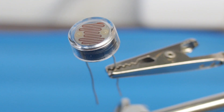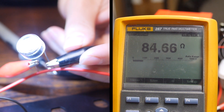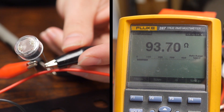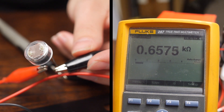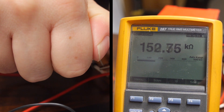Now to make our circuit light-activated by adding a photoresistor as our sensor. This is a 1 megaohm photoresistor, but let's see what its functional ratings are. If I shine a bright flashlight on the photoresistor, it barely has any resistance — close to only 100 ohms. At natural room light, it's around 600 ohms. If I cover it up, simulating complete darkness, it's upwards of 150,000 ohms.